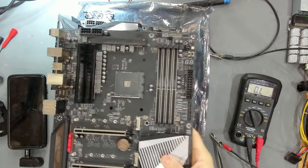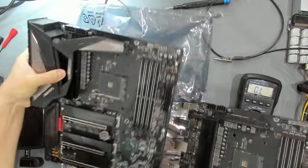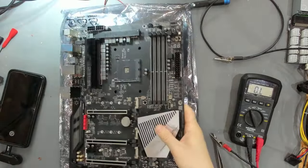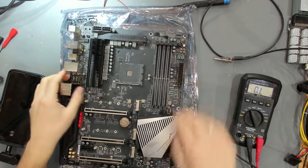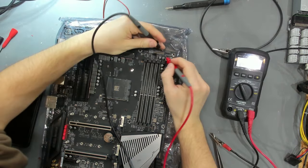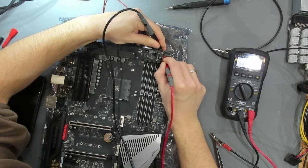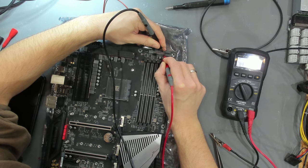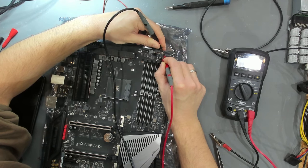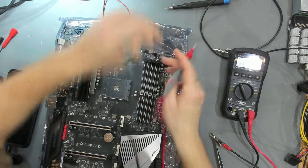Let's take the other board and instantly check the resistance on the PCH via the top test points. Getting the multimeter in here and testing - this has low resistance as well. So this might be fine - this might be the power consumption and resistance that we'd expect to see. Either that or we're very unlucky and have two dead PCHs, which is very interesting.